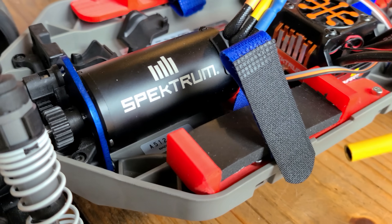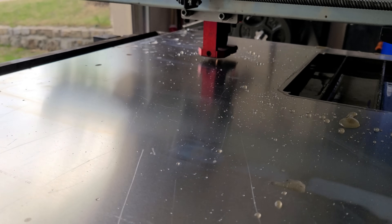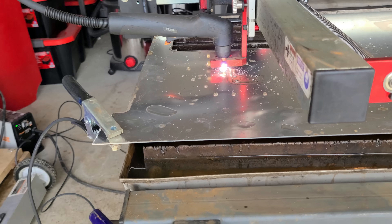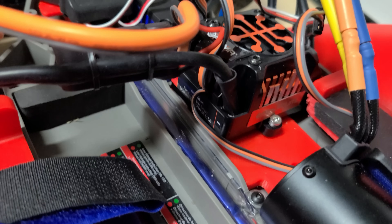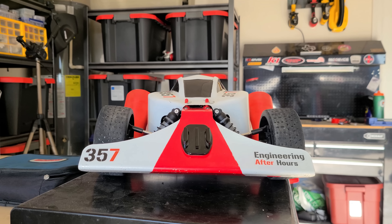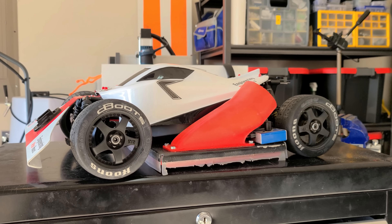It's also a mid-motor chassis, which further improves weight distribution over the legacy two-wheel drive chassis with the motor in the rear. All metal parts were plasma cut, just like the last build. I reduced the under tray area to limit downforce to what I can reasonably use — I actually have enough downforce to not be traction limited at all; I'm power and torque limited by the motor-battery-ESC combo. To improve further, I'd need to change the motor or improve the C rating on the battery. The front wing looks stupid but is only there to protect the front shocks and A-arms — nothing to do with downforce. If you like content like this, please consider subscribing because it really helps the channel.